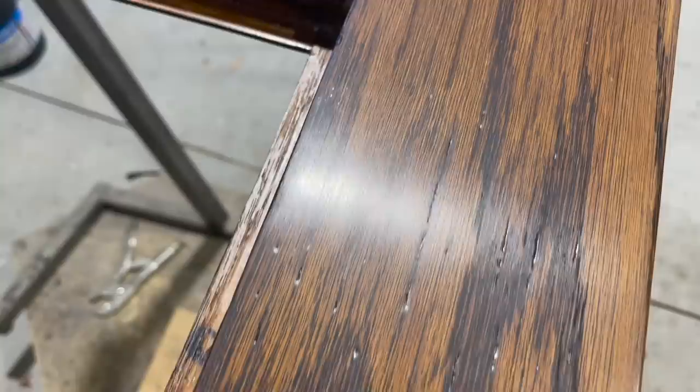And there you go, you've got that nice even sheen across, still have that open grain, which is fine, but you don't have any more of the dull and shiny spots with all of the little points in between. So just continue on with the whole door that way. The other side has 3 coats of lacquer, and it looks good, so we're almost there.